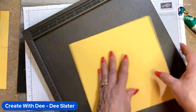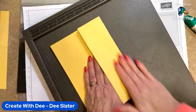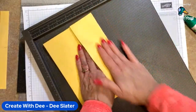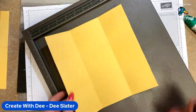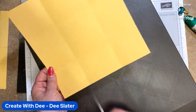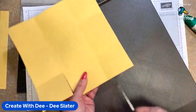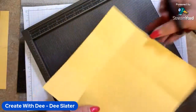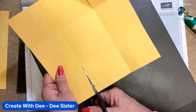Next, we're going to take our snips and do some trimming. I like to give a quick little fold to all of those two and five-eighths marks. Then we're going to trim out the side that's got the score marks — on the two and five-eighths — then turn it and trim up again.